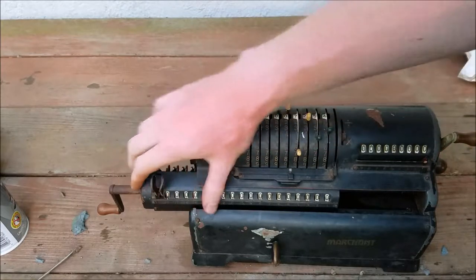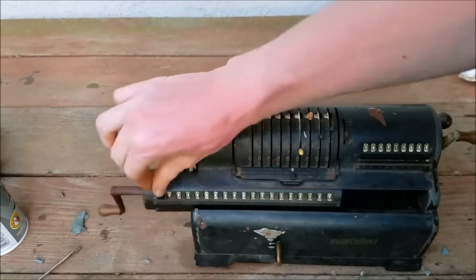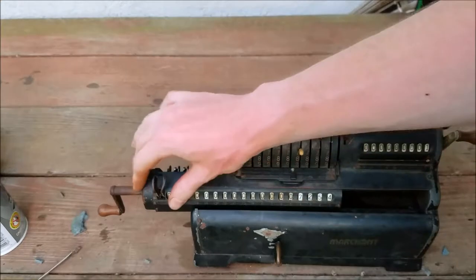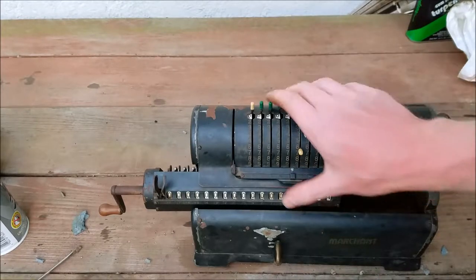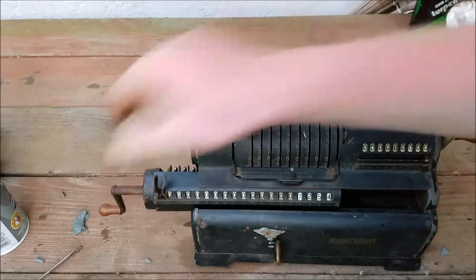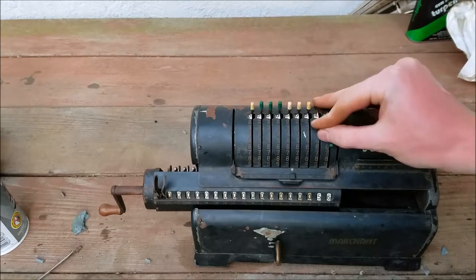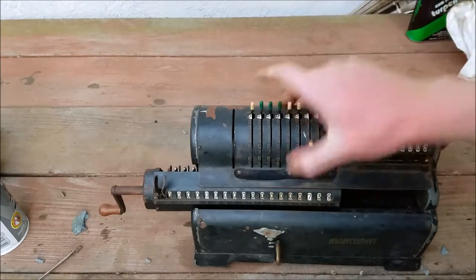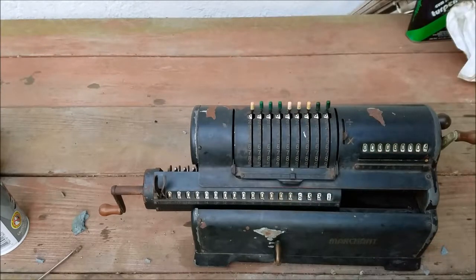It's not engaged. Try again. There we go — maybe the carriage wasn't engaged quite properly. This has to be in the right position otherwise it won't add — it'll block like that. You can see the number that was up there. Let's add it in down here. This clears that, this clears this, and this clears that. So if you wanted to add a series of numbers we can just put them in. It's a nice smooth machine. This is our counter over here by the way — counts how many operations we have.